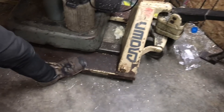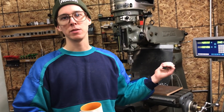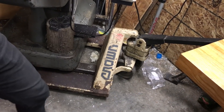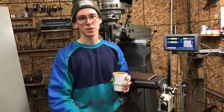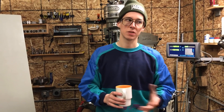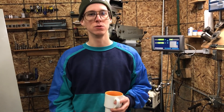This is my pallet jack. I bought it for $170 on Craigslist and it works pretty well. I don't use it very often, but when I need it, it's really nice to have. I can scoot it underneath my milling machine. The Blanchard ground steel table weighs 850 pounds — really hard to move around — but I can get the pallet jack under it and scoot it. My CNC machine is 6,500 pounds. I have an axle that goes under the rear of it, the pallet jack goes under the front, and that lets me scoot it around the shop. When you start to have heavy stuff, a pallet jack really makes it easier to live with these big heavy machines. You don't need a forklift or riggers — pallet jack access, whether you own it or rent it, is really valuable.